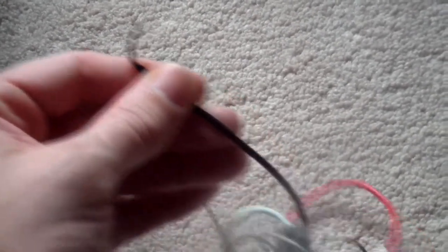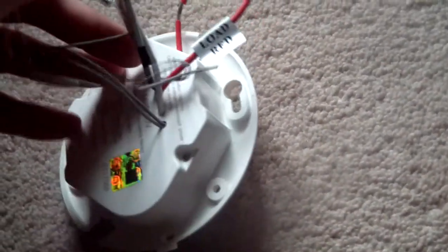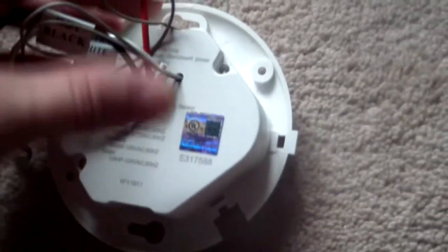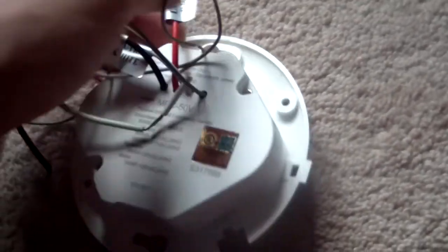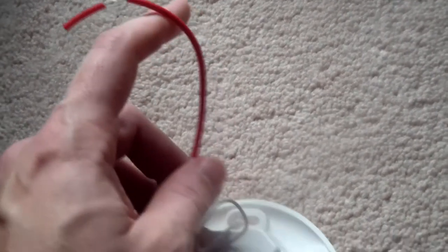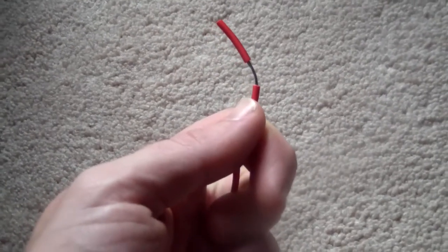The neutral connects to the house neutral — white goes to white — and then the red wire is the switched load from this device. That red wire goes out to the two hots on our new lights. A wire nut goes on to connect to those two black hots, and all the whites get wired together. So the wall switch is upstream of the hot, this sensor switch makes or breaks based on occupancy, and you get your lights to turn on — that's how it's wired.